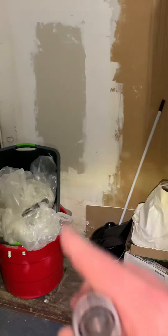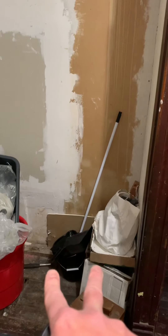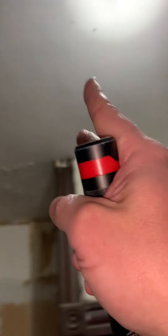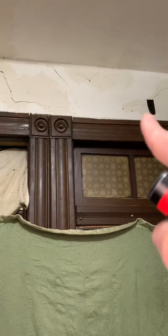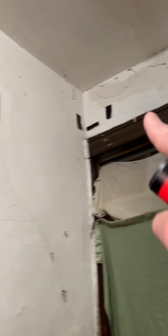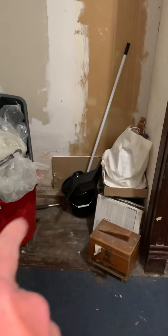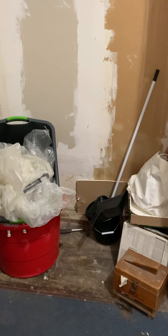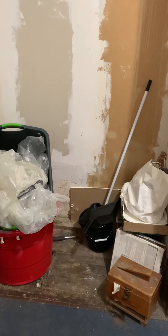This is where the unit's going to sit. We'll have them clear it out, with the furnace sitting here and ductwork coming up and going this way. We'll feed ductwork in both directions, put a register in there, one above there, one above there — ending up with two into that room and one in there. Then we'll cut one into the ductwork itself for the return, just sitting on a base with a return grill mounted to the side of the box, pulling its return air from this space.